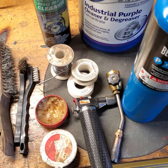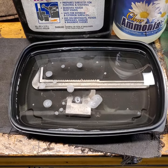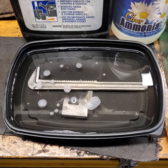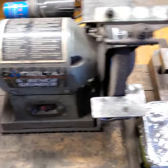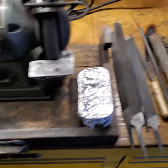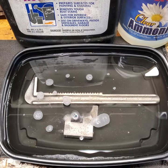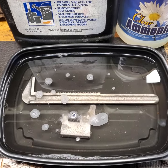But that's not really what this video is about. Here is what I want to tell you in this video - here is one of the first places I made a mistake when I started nickel plating. I assumed when I took the part out of the wire wheel, I assumed when I cleaned it off with detergent, and I assumed when I sprayed everything down with brake cleaner that the metal was ready to go. That's not the case. You have to do this step. But this is an easy step and it involves chemistry - and you don't have to be a rocket scientist.